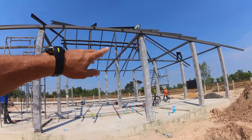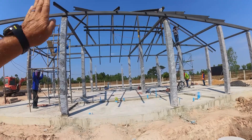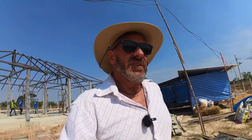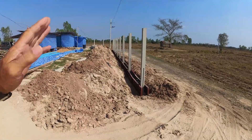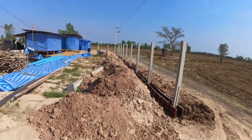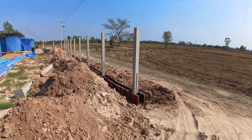They haven't welded the ridge beam into the rafters on either side yet — they'll get them all tacked in up above, then come down, get the spacing, weld them in, and cut them for the soffit. It's hot out here. The fence guys have got all the forms laid out and done around the corner, latching and leveling. I'm sure they'll be ready for concrete tomorrow. The whole thing's off the ground confirmed, so no issues this trip.